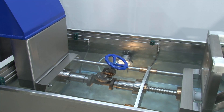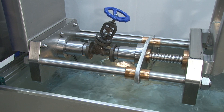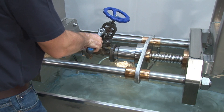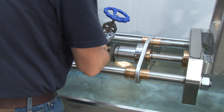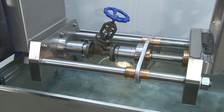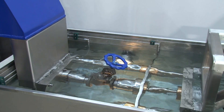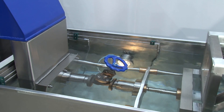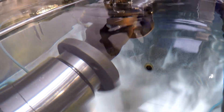In such a case you can release the test pressure, go up with the clamping table, re-tighten the bolts, lower the clamping area, and get test pressure into the valve once again. If the problem is solved, no bubbles are visible anymore.